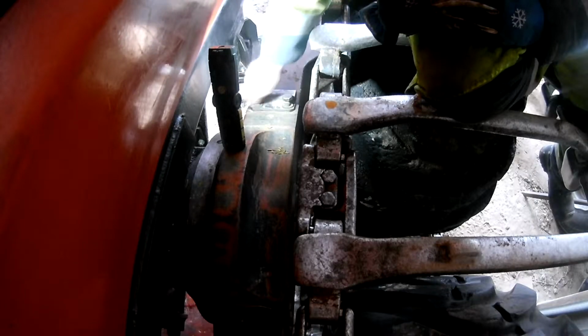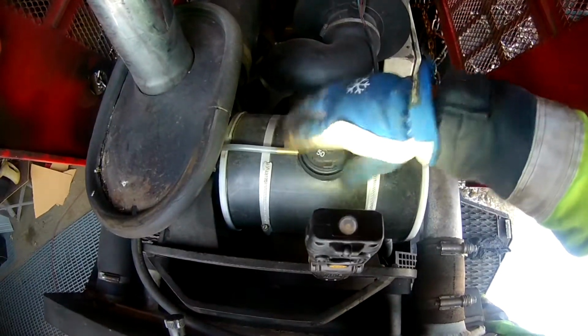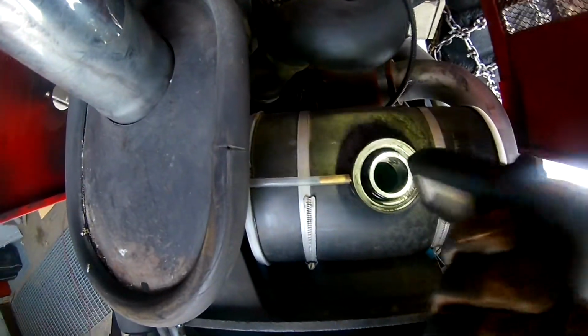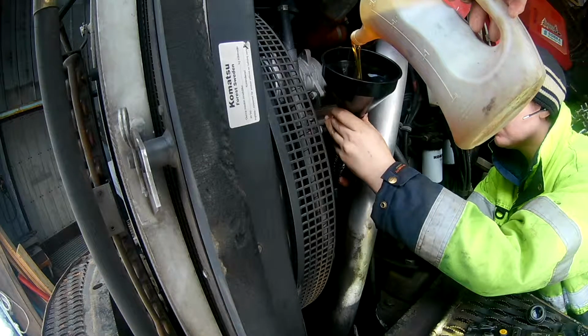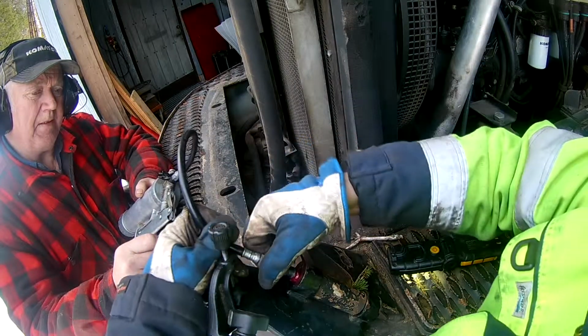Engine oil level was a tiny bit low on both machines, so put a liter more in the forwarder and 2 more liters in the harvester. Check the coolant also, since the hood was open, and I've seen when it was really cold at some point a tiny bit of coolant seemed to be seeping out through one of the hoses that was tightened up.